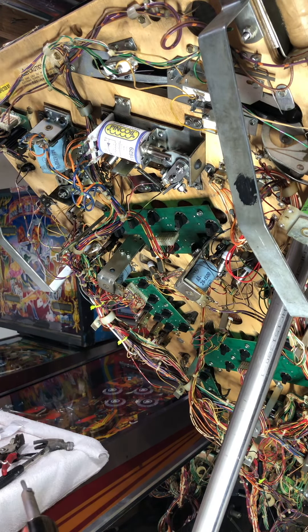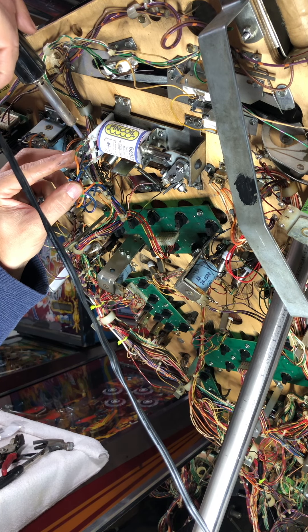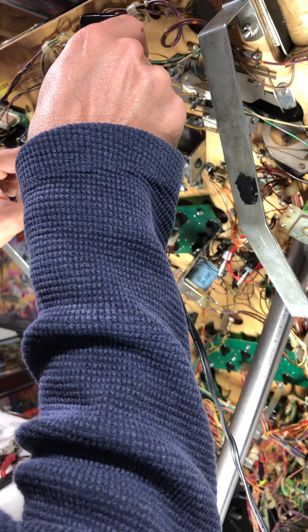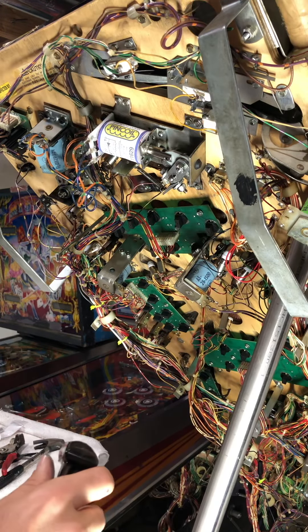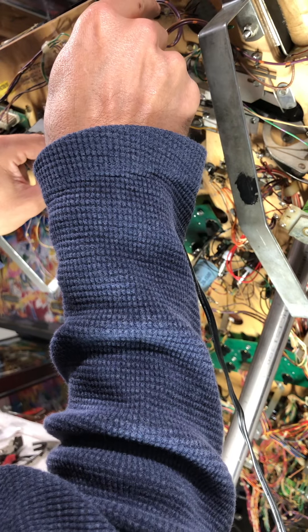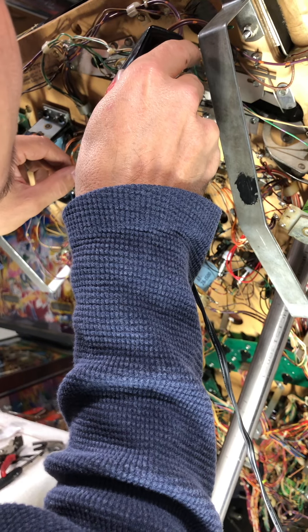Didn't go through the back side. A little more solder on the iron — get that thing to bleed through. Probably need a little flux on there to let it flow a little better. That one's being a little pain. A little bit more on there on the back side. When I do a job, I like to do it right — no half-assing over here.